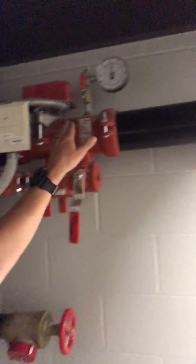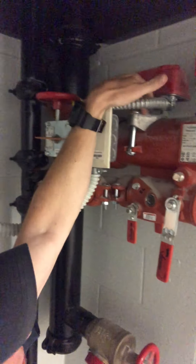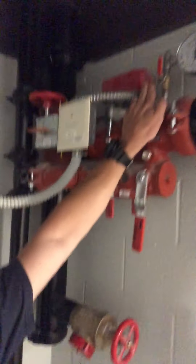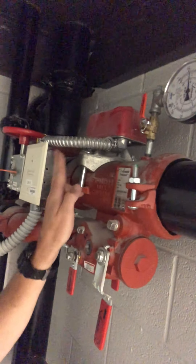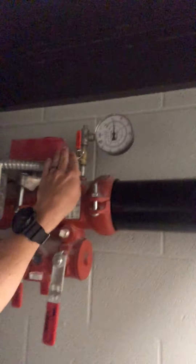Some other features on here: you have your water flow switch on the top right here. It's actually a little paddle wheel that goes inside the piping itself and moves back and forth. So if a sprinkler head were to rupture, water will flow, and that is what's going to give you the signal — you can see the conduit here tying back to this component — that's what gives you the signal that you have water flow on the first floor, tenth floor, whatever the case may be.